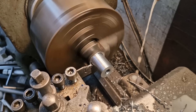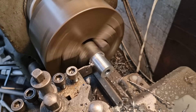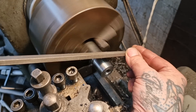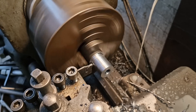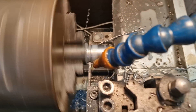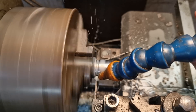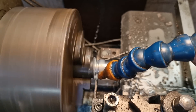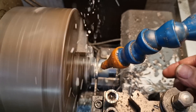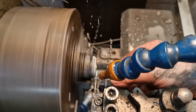The last operation is to part that off, so we'll just make a start. Then we'll break those two edges, get in there and break that edge, give it a bit of water. Well done — now you see what I see. Cut off in short order — although you're getting absolutely drenched. There you go, job's a good'un.